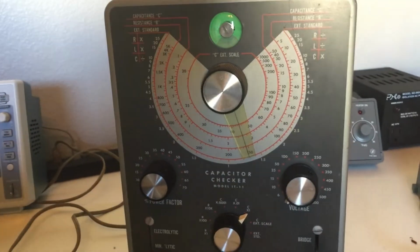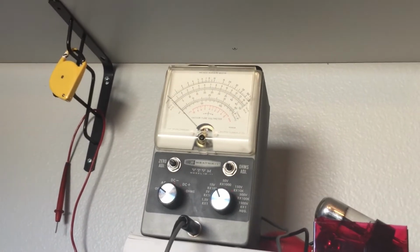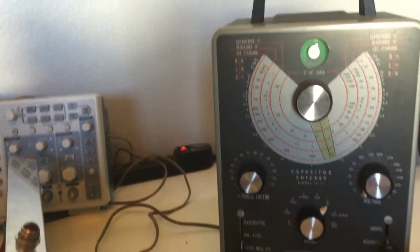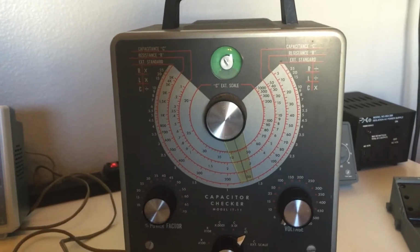It is Heathkit. It does go back to the 50s. They are somewhat older, you know. So when I have nothing on the bench, I like to make sure that my Heathkit stuff is operating correctly. So when I do use my Heathkit stuff, my decade resistance boxes, my decade condenser boxes, which is very useful in circuit on these pieces of equipment, especially when you're adjusting biases and different applications on these tubes. I could open up a particular resistor or capacitor, knock one of those boxes on there, do a mathematical calculation on paper, dial it up right in there and check the output on the hand tack. But sticking with the story, I digress.